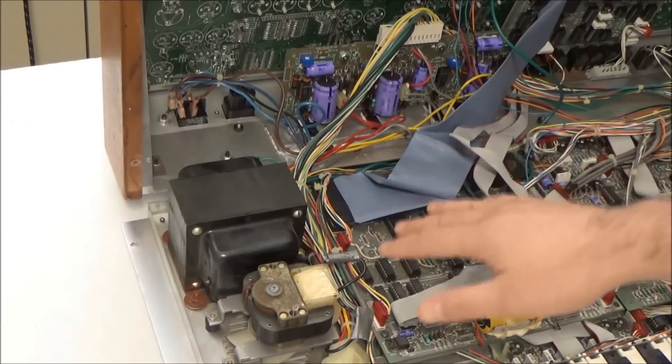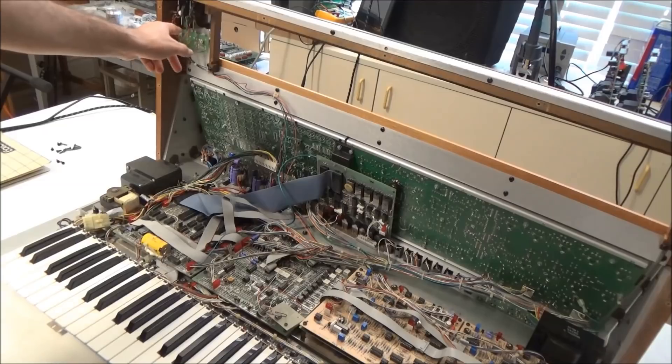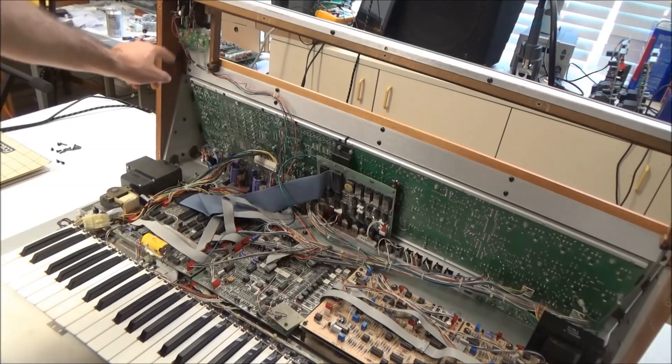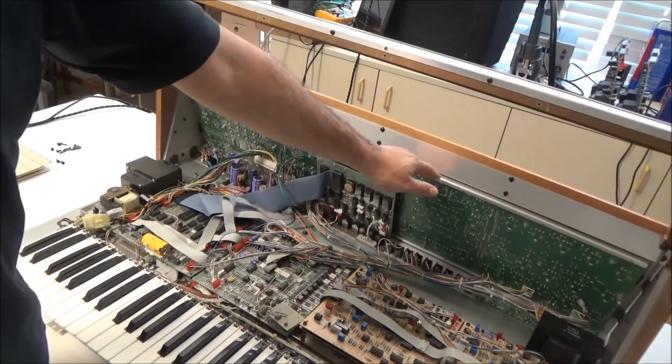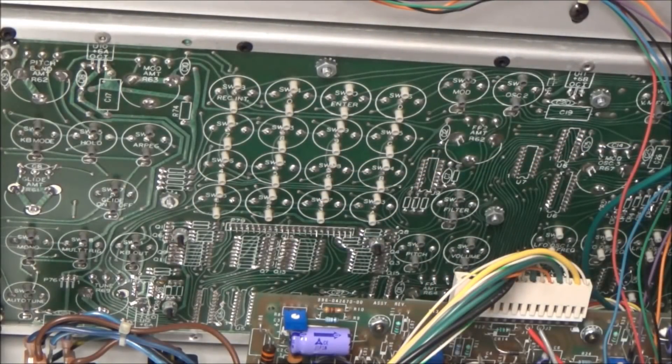In the upper half of the case, there's not a lot of interesting stuff. Here we have the pitch and modulation wheels, a little circuit board for the octave transpose switches, and two large circuit boards here called the left and right side control boards. These boards basically have all the switches, LEDs, and pots. They're arranged into matrices of rows and columns, and there's a little bit of circuitry on this board that multiplexes them, so the state of several switches or pots can be transmitted over the same wire. Because this is a Memory Moog Plus it has MIDI, so it has this extra board which adds the MIDI jacks. For more details about switch matrices, look for my video Synth Chaser number 95.